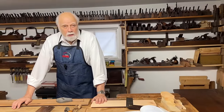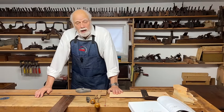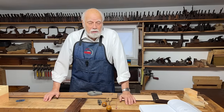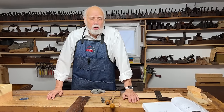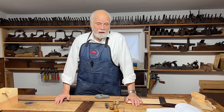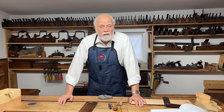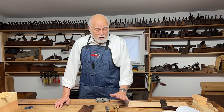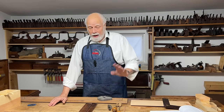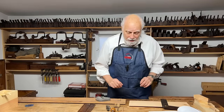That's one way of doing it. But I could also, if I were just roughly marking things, use a piece of chalk. That's what a lot of old cabinet makers do. In fact, if you take an old piece of furniture apart and look at a part you don't normally see — like the underneath of a drawer or the inside of a cupboard — if the piece is 100 or 200 years old, you'll very often see the original chalk marks that the cabinet makers used. Chalk is much better than lead because it's more easily got rid of and can absorb the stain. So if you really have to make a mark, use chalk rather than a pencil.